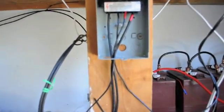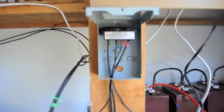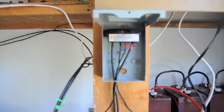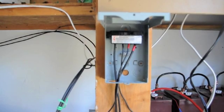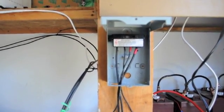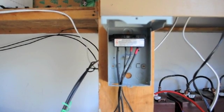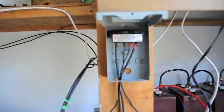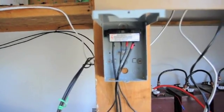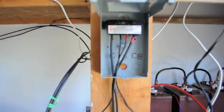I've got a positive and negative lead from the solar panels up there, and those panels are hooked in parallel. They're rated at about 37 volts. If you have two or more panels you want them rated close to each other — within maybe five or ten percent — if you're running them in parallel. You don't want a panel that's 40 volts paired with one that's 20 volts; that's not going to work. One of mine is 37V and the other is about 37.5V — they're super close.